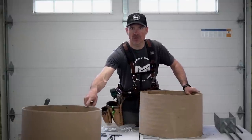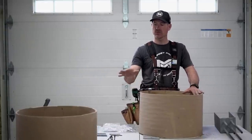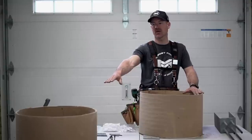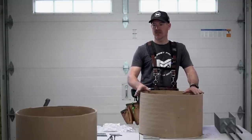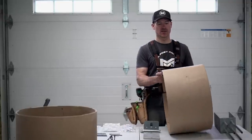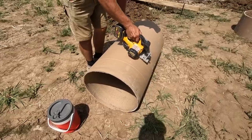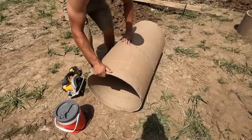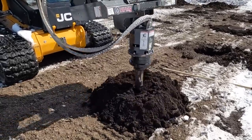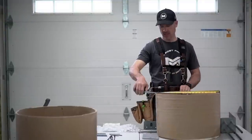What we have here is a sonotube — this is a full-length one. We do not use a full sonotube unless absolutely necessary. We'll either buy 12-foot sticks of sonotube or, like in this case, get them from our steel supplier off coil cores for really cheap and cut them down. Basically 13 to 15 inches is what we do. We use a 16-inch auger, which ends up being an 18 to 20-inch diameter hole. These are 20-inch sonotube.